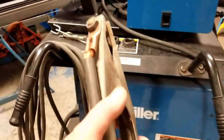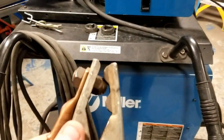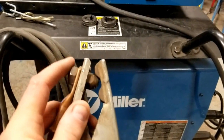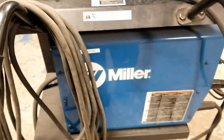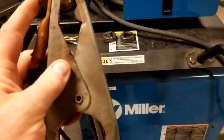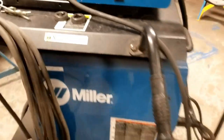So the ground clamp itself, again, I want to make sure that it's working correctly. It's a heavy spring in there. It should take a lot of effort. I want to make sure that there's no loose connections on this. And ultimately, when I hook the ground up, I want to make sure that the side where the cable physically hooks to is connected to the side of the material that I cleaned, okay? There is a braided cable inside this clamp, if you can see this, that connects one side of this to the other. But again, we want to minimize the electrical paths when we hook up. We're going to make sure that the side of the cable hooks to is in fact the side that is connected to the clean part of the circuit.